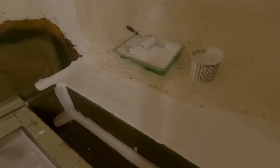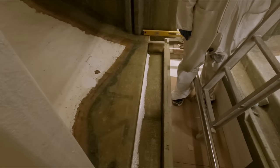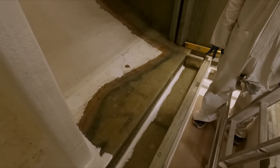This is the gel coat layer here, bringing it down halfway, and then the second layer, same thing. That'll give me room enough to get a grinder in here just to knock off that sharp edge if there is any. Give it a nice transition there in the sump where you can't really see it. And then, I got this divider wall done. I'm also stopping right here and right there for now, because once I coat this, it'll be pretty hard to traverse over there where I need to coat the bulkhead. So, just taking it in steps and trying not to overwhelm myself.